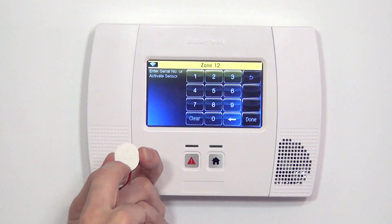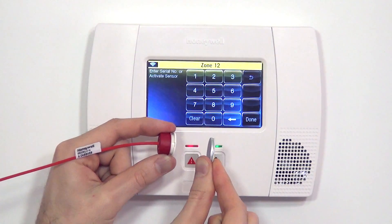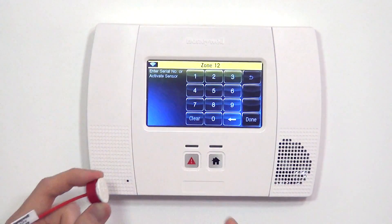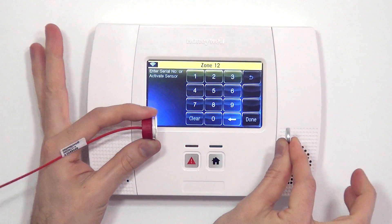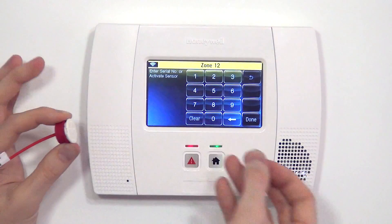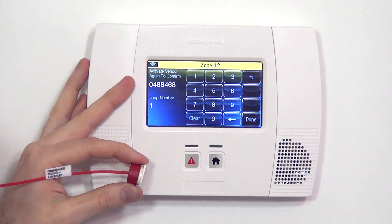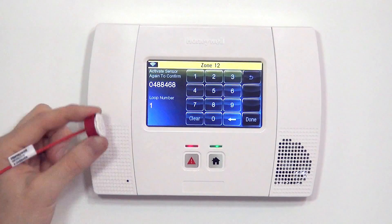What's important on the surface mounts is putting the magnet on the correct side where the reed switch is. With this device, the reed switch is actually going horizontal, in line with the indicators on the device. You want to make sure that when you fix these to the door and frame, you're not mismatching — you want the ovals to be together horizontally, instead of one being vertical and one horizontal, because then you won't get accurate faulting and restoring of the zone. So now that we have them aligned in the horizontal oval position, we bring them together — that would be the door closed. To activate the sensor, we open the door. That's activation number one; the sensor is pulled away from the magnet and we hear the panel beep. We close the door again, and then open it. Now we get the double beep along with the serial number, which matches the serial number on the device, and we get loop number one — the accurate loop number for programming this sensor. If you're typing it in manually, always select loop number one.